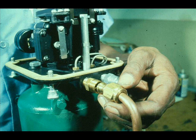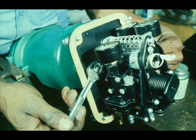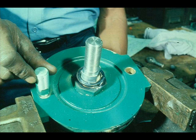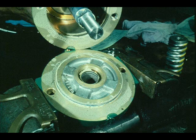To disassemble and inspect the piston internals, remove all air lines from the positioner. Disengage the range spring from the actuator's stem. Loosen the two cap screws that hold the positioner to the cylinder. Remove the positioner, but don't lose the O-ring that gaskets the part connecting the positioner to the cylinder top. Remove the stem connector and the rubber boot. Remove the socket head cap screw that holds the cylinder to the yoke. Remove the cylinder, using a screwdriver to pry it off the yoke. The piston and the piston rod will come out with the cylinder.